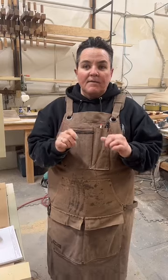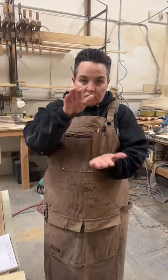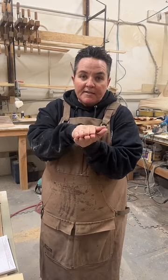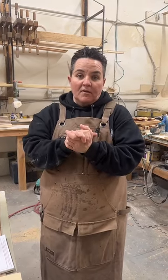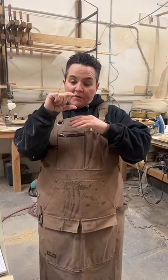The key to drunken cutting boards is you have to cut them so that they are exactly the same. The only way that you can get that, without a CNC machine or a perfect template or jig, is to sandwich them together with two-sided tape and cut them at the same time with your bandsaw blade at a 90-degree angle with no flex in your bandsaw table. Because that will, depending on the thickness of your board, throw your cuts off.